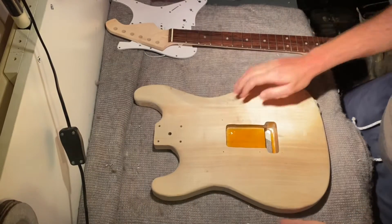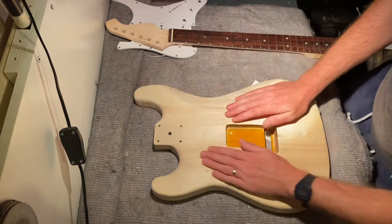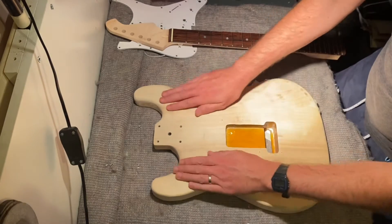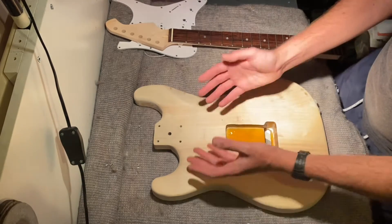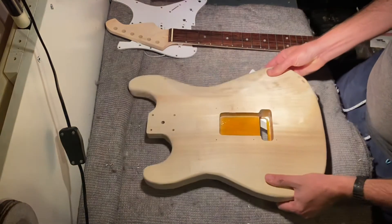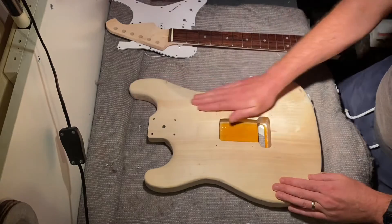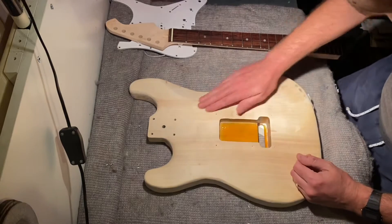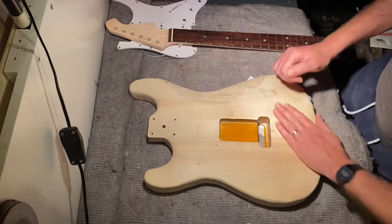Good evening, people of YouTube. I think I am ready now to start the actual treating of the wood. I've decided on a light oak stain, which I'm hoping will bring the grain of the wood out. I've managed to get rid of all that horrible resin — it is a lot lighter now. I've taken it as smooth as I possibly can, going down to P600 fine sandpaper. To my hands it feels silky smooth.